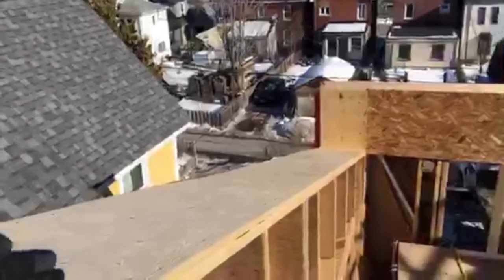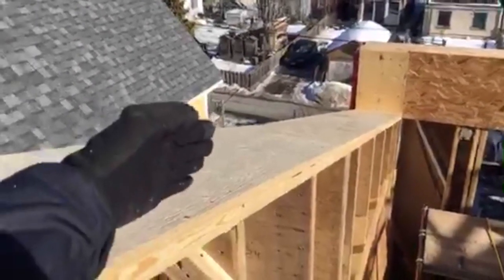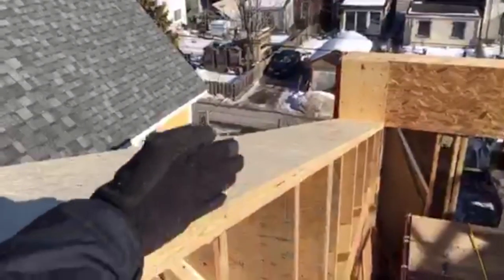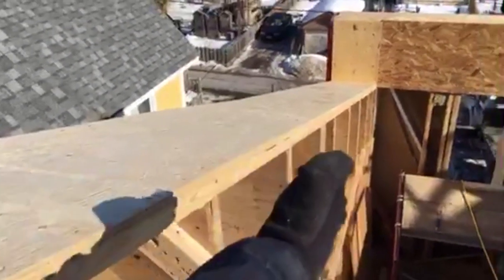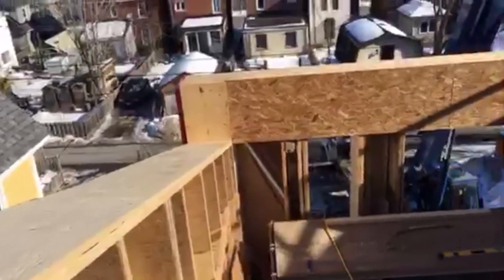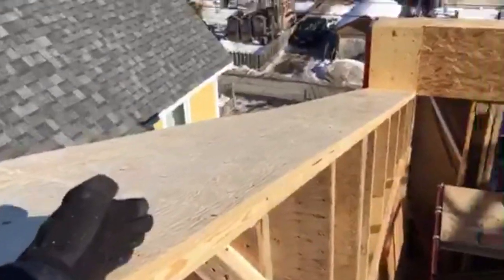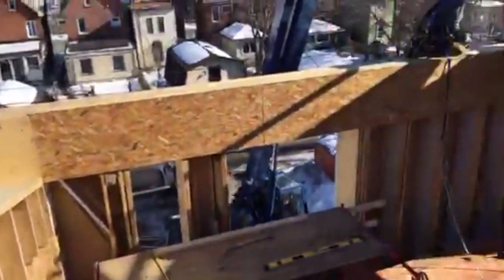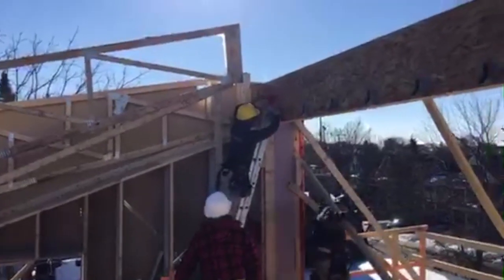So what we've just caught on site as we're putting this one into place, we need the first of the hangers above us to be no more than 24 inches off of this knee wall so that we don't have too much of a span for our roof sheathing. And we'd measured 24-inch spacing from the outside wall. It's a bit of a miscommunication because this wall is not 24 inches thick. So we're going to relocate that hanger.